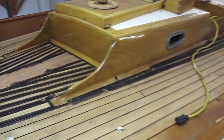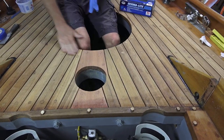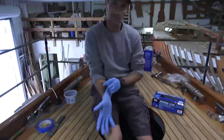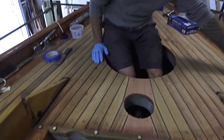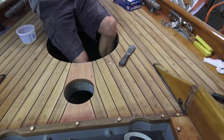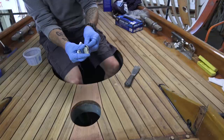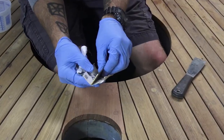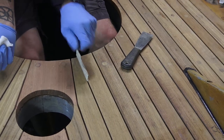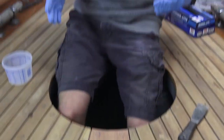The caulking has commenced. This morning I was already sanding these seams right here. And right now I'm going to just prep with some acetone, then start caulking them. Sanding them with a little paper around a block — made this little block, a piece of bronze, pretty much the perfect size, just to make them all uniform. We've got to get all the epoxy that dripped in there.